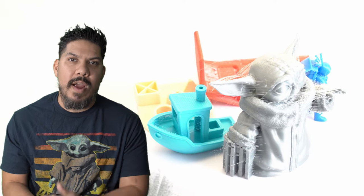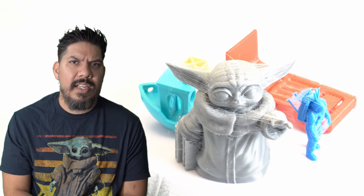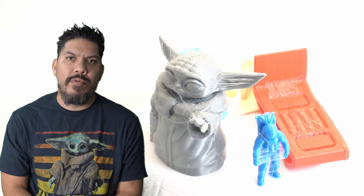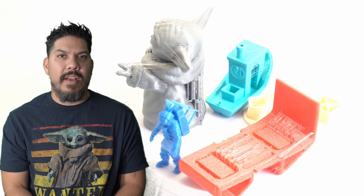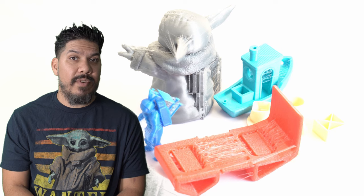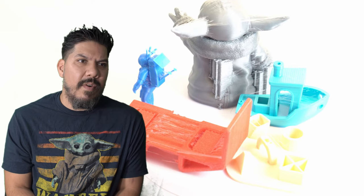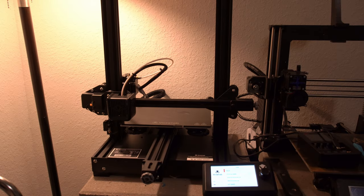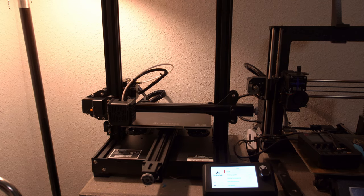The TPU quality was not quite as good without any tuning compared to my Prusa, but that's an $800 printer. These prints in TPU are perfectly usable for a drone pilot or anybody else that just needs these pieces for protection. If you spend a little bit of time doing retraction calibrations, you'll be able to get that gap in quality much, much closer. Look at the quality of this versus an $800 printer — right out of the box. It comes with a silicone sock on the hot end that really keeps everything nice and contained and helps prevent heat creeping onto your prints. It's just beautiful.